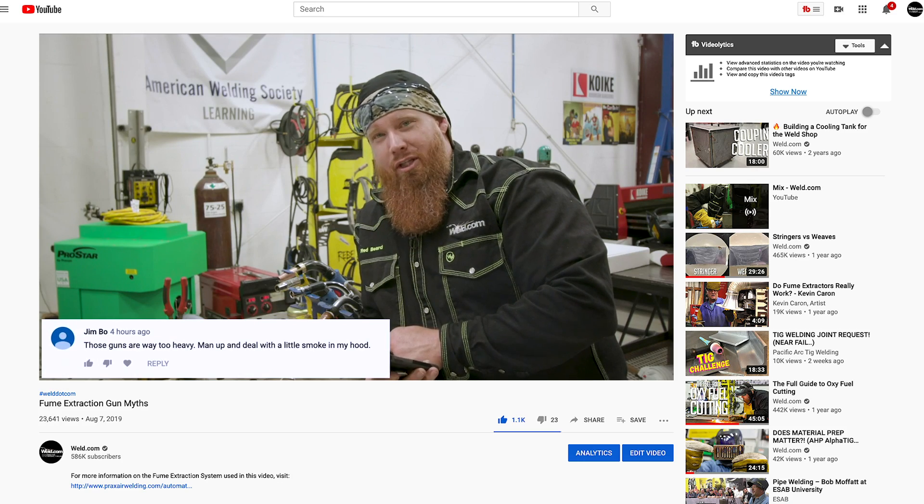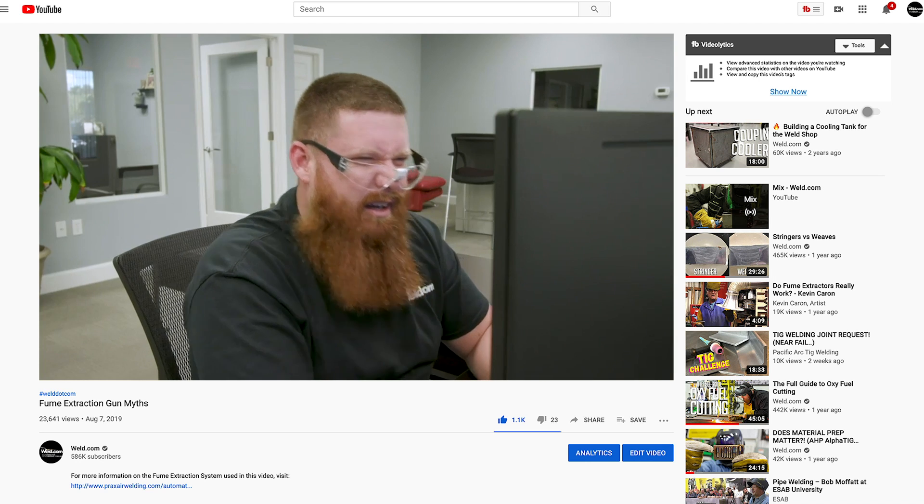For those that don't know, I'm a big fan and proponent of this stuff. I teach full-time, and fume extraction is something we as welders need to take very seriously — it's nasty stuff you don't want to breathe in all day. I really enjoy using these guns because I don't have to wear the cumbersome equipment. A lot of people think smoke extraction MIG torches are too heavy. It used to be true, but with the latest version of the torches, we use lightweight power cable inside and trimmed all the unnecessary weight so the torch is comparable in weight to a regular MIG torch today.